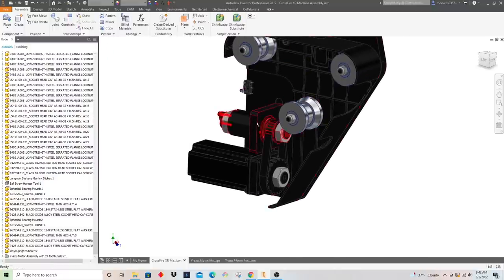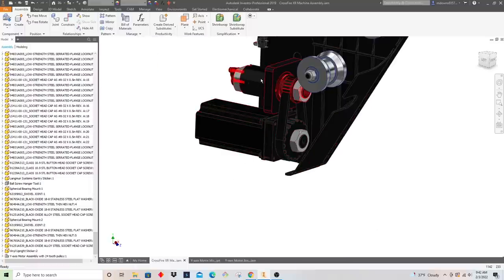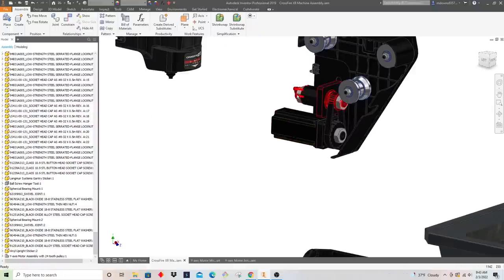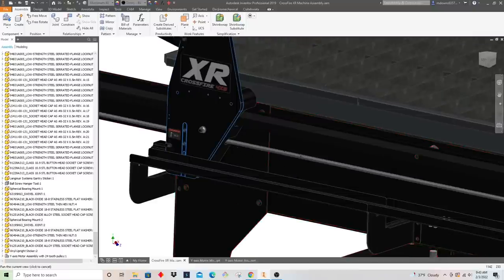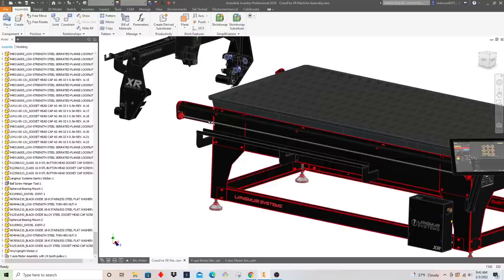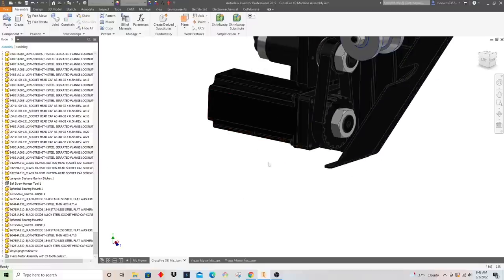As I zoom in here, you can see this is the gantry upright, and we have a driven ball nut system here. There's a stepper motor, and it has an overdriven timing pulley that is driving the ball nut hub here. And as this stepper motor rotates, it rotates this ball nut. And as you can see, it allows this gantry to ride along the Y-axis rails. And the ball screw is right here. So this is a rotating nut design. It allows us to use a much longer ball screw here without having any issues with whipping and things of that nature. And so far it's worked very well for us.